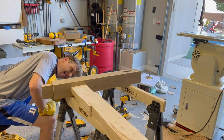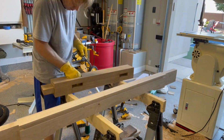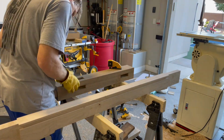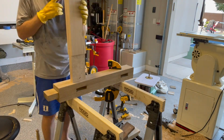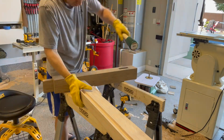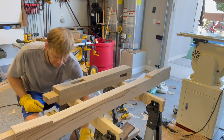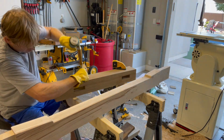It's really tedious. The minutest of adjustments and try again and adjust again. And I think the trick is don't be too aggressive, and even if you're worried about the looks, even the finest of adjustments matter. And you see, I actually brought out the wood file. Even when you get right to the end, just a rasp or a wood file is all that you need. The board won't go through. A couple file strokes later, and it fits just right.